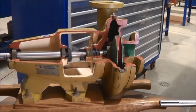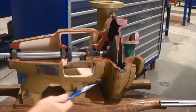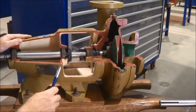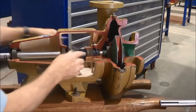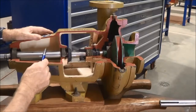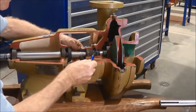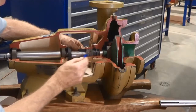Here's another type of pump. We can see the shaft and the bearing housing and the bearings that support the overhung shaft. In this case we have a slinger — just a rubber washer-type element — which is put onto the shaft and stops the water that might escape from the impeller housing from traveling along the shaft and entering into the bearing housing. We have the gland there, and we have three rounds of packing and a lantern ring assembly just up close to the impeller.